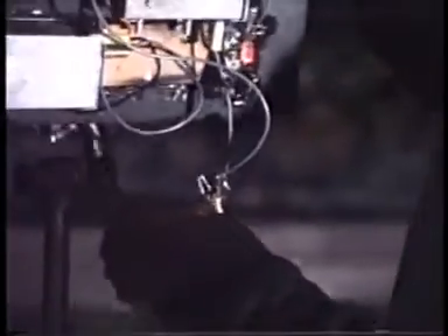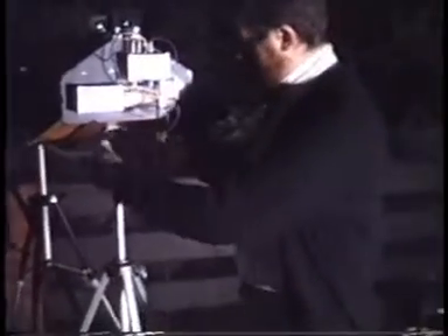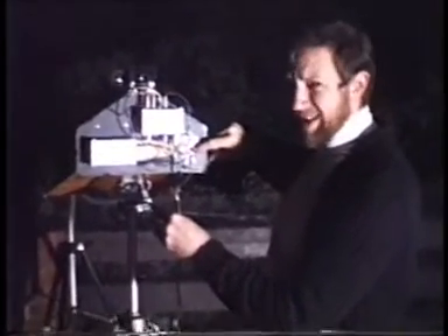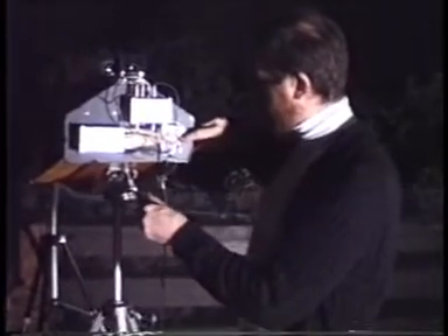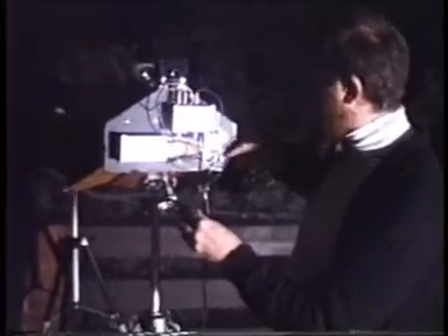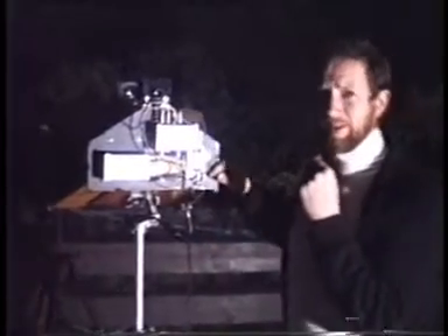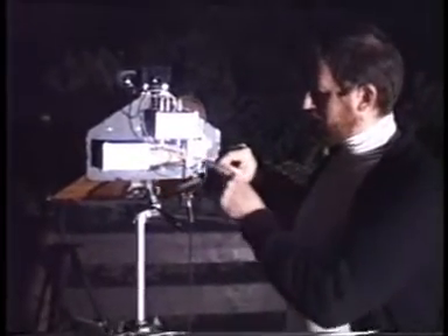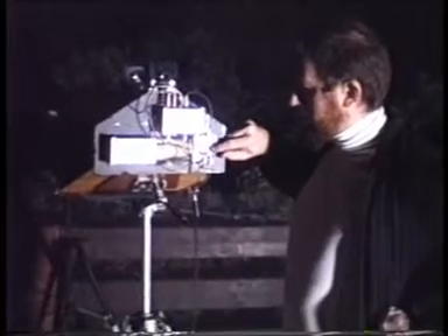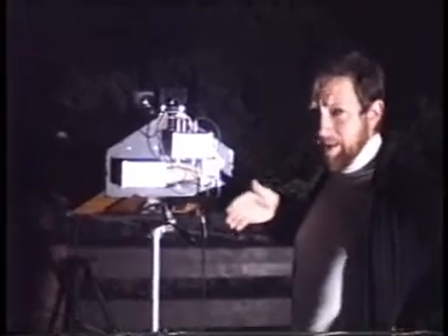So it's all very, very straightforward. Now, as far as what's inside the actual device is concerned, we've got a 2,000 millicandela LED there. What you're seeing is only by backscatter inside — so that's a two candela device. What have you done to that? I've shaved the lens off it — the convex front's been shaved off. So what is just the chip inside showing.